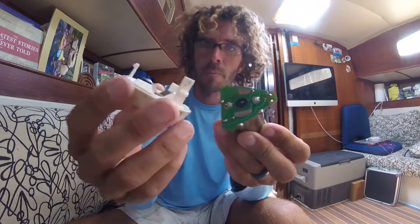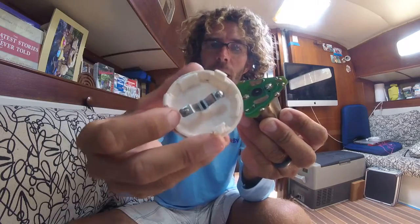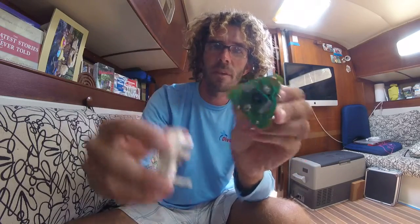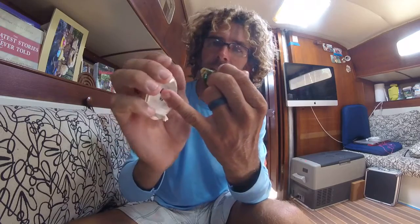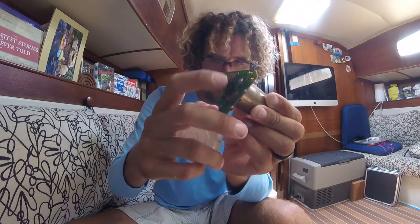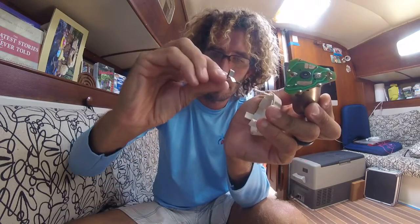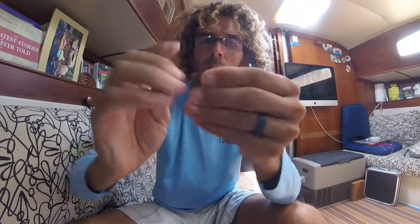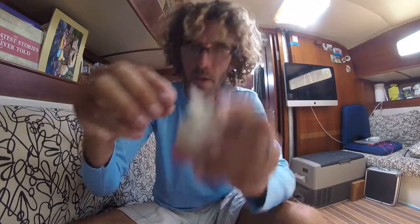Clean your contacts. This is the back cap — the control cap — that basically helps adjust the speed of the fan. On the back of that cap are the contacts, right here and here. Those contacts go tick-tock tick-tock over top of the sensors back there — that's how power gets transmitted. When the motor starts to get weak and the fan starts to die, these contacts get worn out so they need more pressure. This little metal piece in the cap, just pull it off like this. Then bend these contacts forward a little bit just like this, and make sure they stay nice and tight so when you push it back on the cap it has tension.